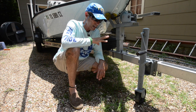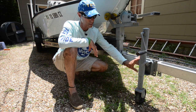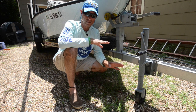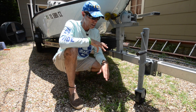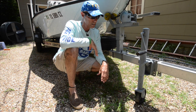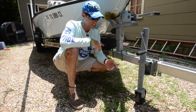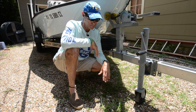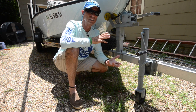So I took it off, had it fixed at the machine shop — they lifted the tube up in the bracket so now I have full articulation. It stops right here and everything works fine, and I don't have to keep lifting the tongue anymore. Then I brought it home, brushed it off with a four-inch brush on a grinder, and painted the whole thing with a cold-galvanizing paint — Rust-Oleum cold galvanized paint.